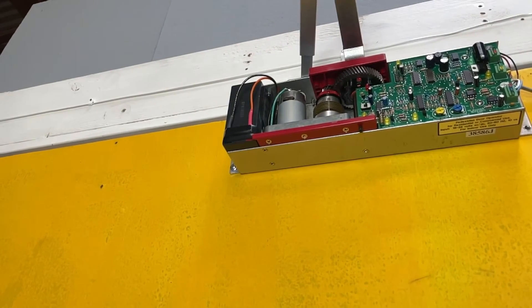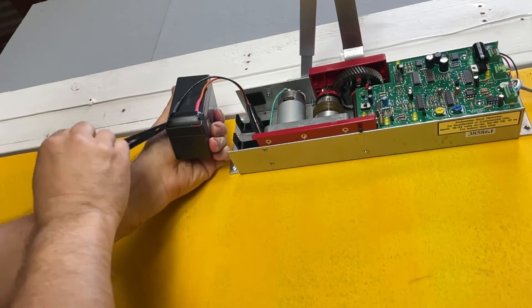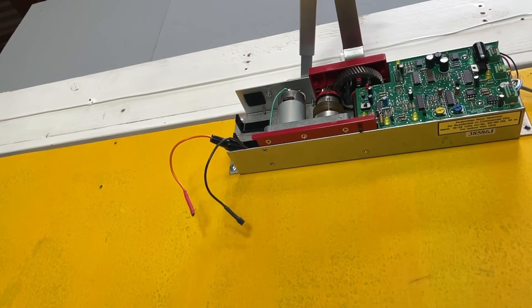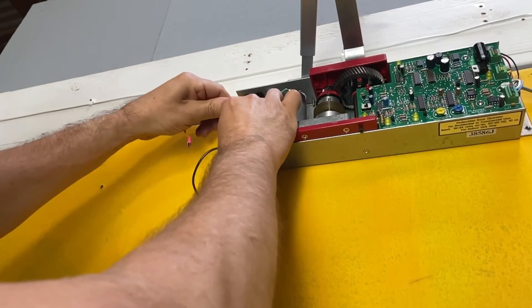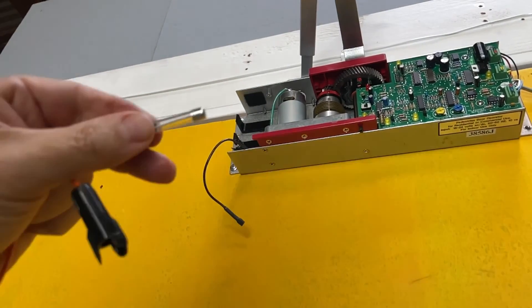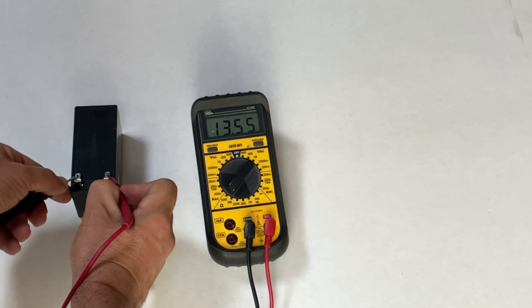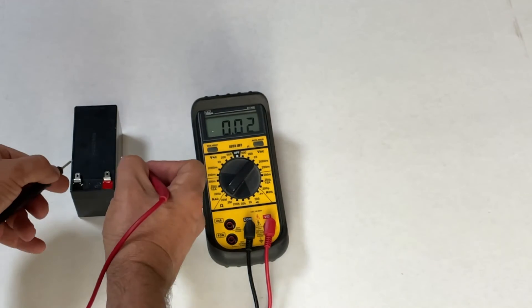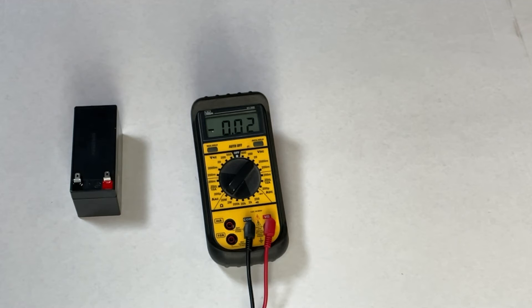With good wiring and the green light illuminated, we now know that the battery is getting power to charge and we can test the battery. First, turn the OpenSesame operator off, then pull out the battery — you can see it simply pops out. Pull the tape off the battery, disconnect one of the terminals (black or red), and inspect the fuse. There is a fuse that runs along the orange wire; simply push the black connectors together and twist to release it. The fuse should look clean. Now place the connectors of your voltmeter onto the battery terminals. With your voltmeter set to 20 volts DC, the battery should read 12 to 14 volts. If the battery is under 10, it means that it is getting old and should be replaced. If the battery is under 6, it hardly has enough power to even run the circuit board.